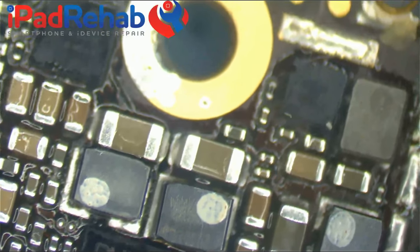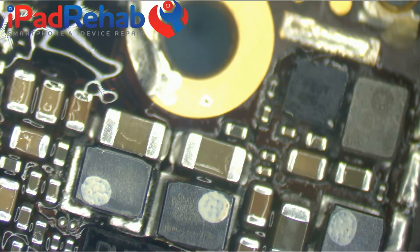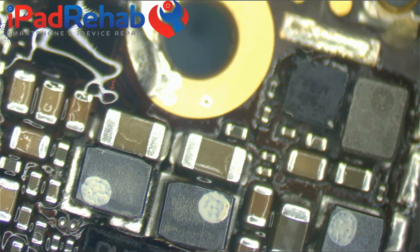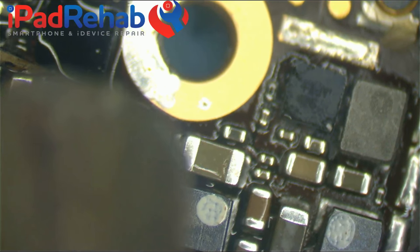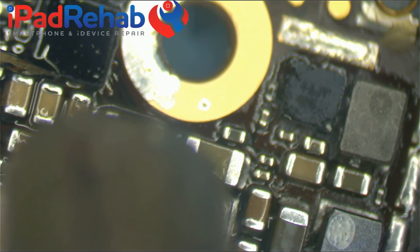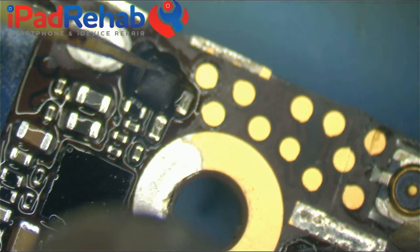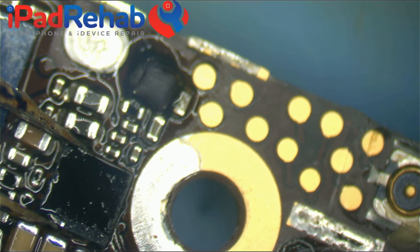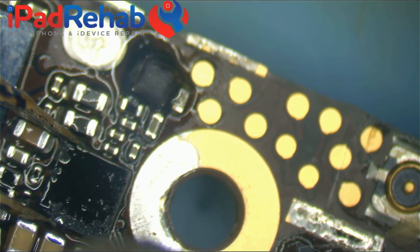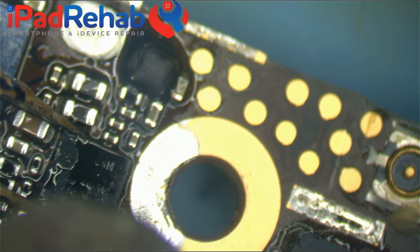All right, so let's get this chip off. And we'll inspect to make sure that we didn't have that accessory 3VO line ball down. And we've got to make sure we didn't bother Q2, which is this little guy up there who could get bothered by heat, and invalidate everything that we've learned. Just throw it right in the shit pile. Another video that is completely misleading and doesn't even tell the truth.